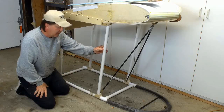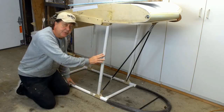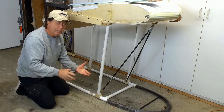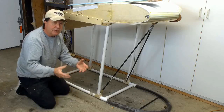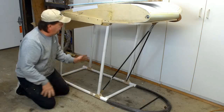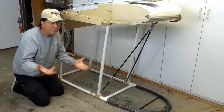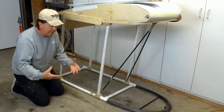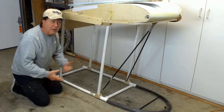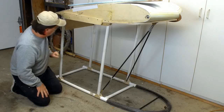The tubes can be quite lightweight. If you're not having to carry the pilot loads up to the framework, then you can make this tubing much lighter because you really only have to deal with ground handling loads, perhaps landing loads, and just general durability of assembly and disassembly. So I'm going to be able to go a lot lighter on the pilot's frame. There's going to be a lightweight harness like a mountaineering harness for paragliding, those very slim, lightweight ones for supporting the pilot. We don't need a harness that has reserve parachute capability because that's going to be a ballistic chute up inside the wing here.